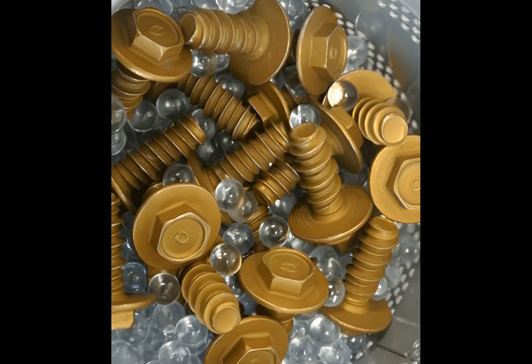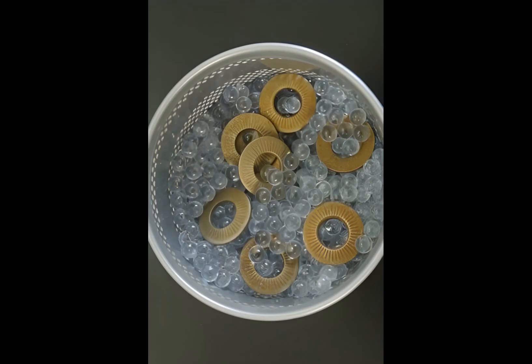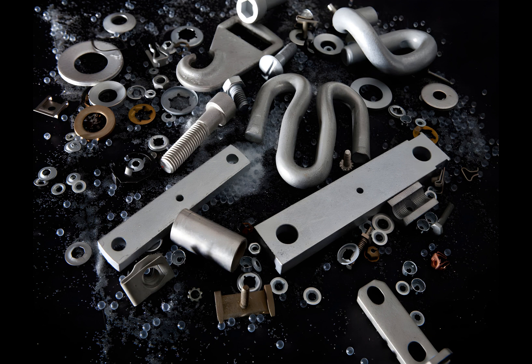Note that the medium is reused many times. This process works better if the workpiece's surface finish is slightly rough. The most important piece of equipment in the process is the tumbler. It is constructed of steel or stainless steel and lined with an acid and abrasion-resistant material, such as neoprene, polypropylene, or polypropylene variants. If the speed is too fast, lumpy deposits will form on the workpieces, but if the speed is too slow, the metal powder will not deposit onto the workpiece.